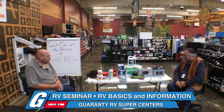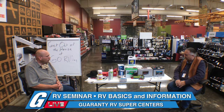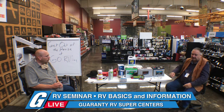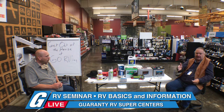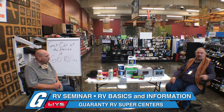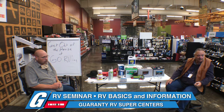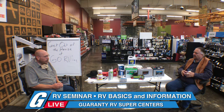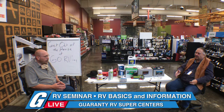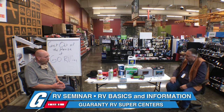A couple of caveats: Dave Taylor has been saying for years that if you have a battery bank — two batteries or four — and one of them goes bad, while it was going bad it was breaking the other battery. So if you have one go bad, you've got to replace them all. You're always best to replace them as a whole set.